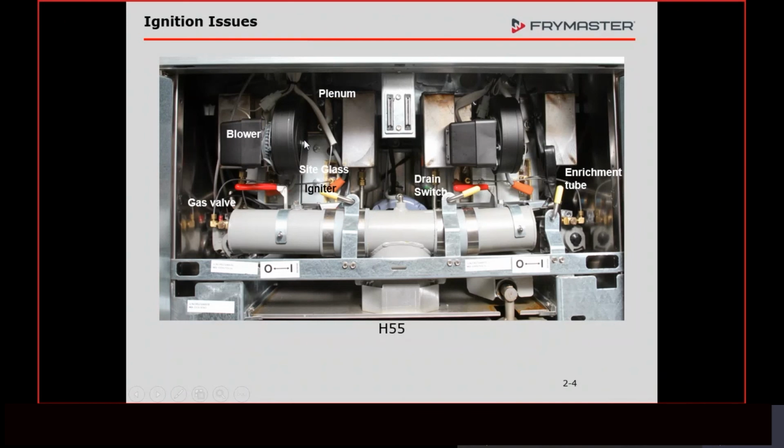Now, is our gas air mixture on? Maybe not. If we have a flame in there, but yet it's still locking out, our issue is we're not getting a signal that's good enough back to the ignition module. Now, what signal is good enough? When we get to the modules, I'll show you the range that we have to have on each module. If we're not getting a good signal back there, what we have to do then is check to see what our signal is going back to the module.